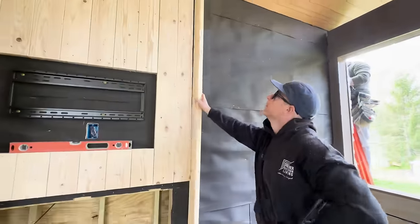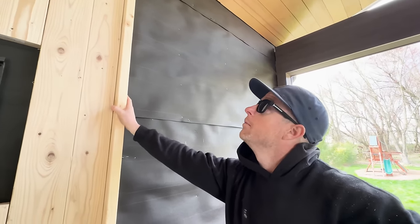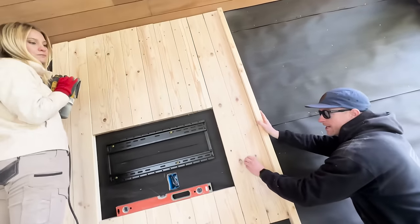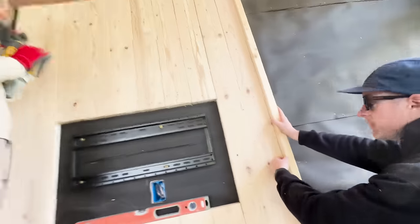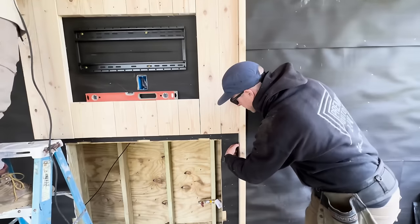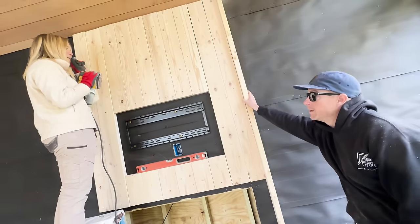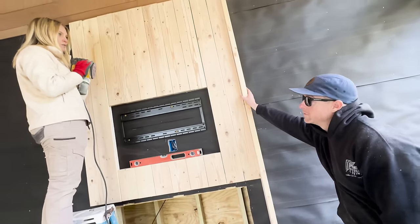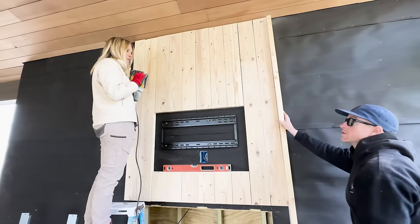Alright, we might wanna sand the sides of this before we put this up as well. So basically we've got this all built out 1.5 inches. Then this is 3 inches, so we've got an additional 1.5 inches. This just needs to be the full 3 inches because this is gonna be the edge butting against our stone on the inside of the fireplace. But aren't these feature strips gonna stick off 3 inches from here? No, they'll stick out 1.5 inches. So everything with this is gonna be flush. Like all the pieces that stick out are gonna be flush.